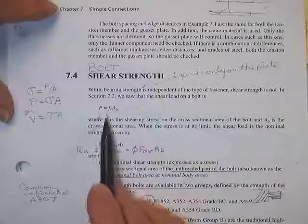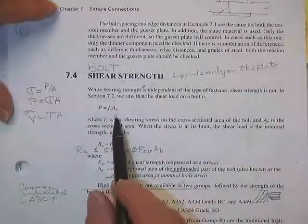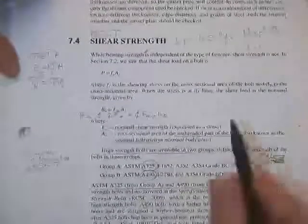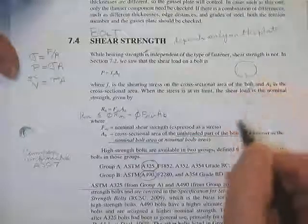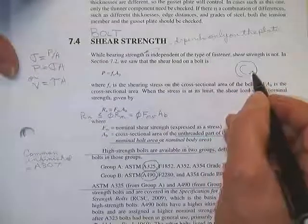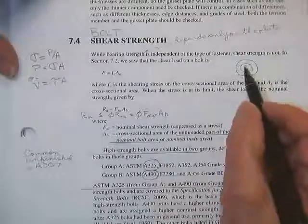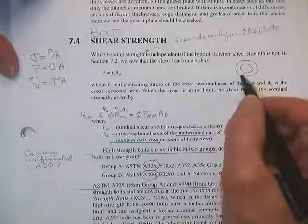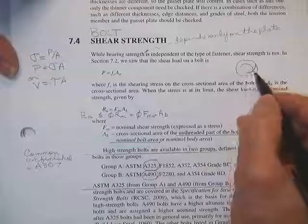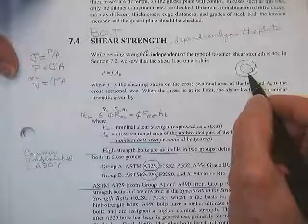Basically, the allowed load would be equal to whatever shearing stress you're going to permit me to put in there times the area of the bolt in shear, whatever the area of the bolt happens to be, or whatever you consider the area of the bolt to be. For example, if you have a bolt and you cut the shank, you cut all of the area that's in there. If, on the other hand, you consider that you have cut threads in it and you think that's the area over which the load is distributed, then you would use what we call the root area. If, because it's impossible to cut through a bolt without at least picking up one thread, then you might have the calculation of this area plus how much area is in a thread when it gets cut also be a little higher. That would be called the tensile stress area.